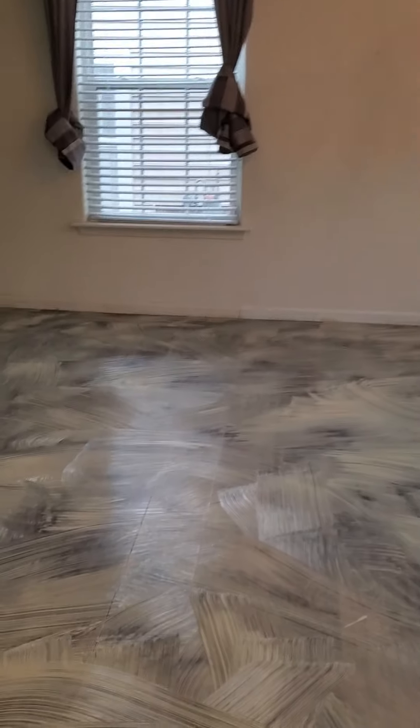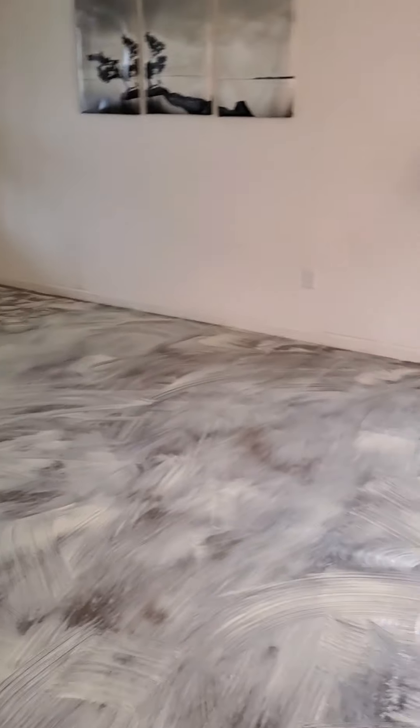I'm happy about that, I'm not mad. I just wanted to stop — I'm taking a break for real and wanted to film a little bit and just let y'all see it. Here's a view of the other side of the room — all glued down, baby. That's the glue for the vinyl. We went with the glue down so that we could have the grout lines. If you do the floating click-install kind, you can't have grout lines unless the tile itself has fake grout lines in it.